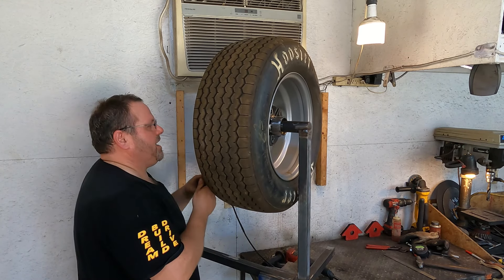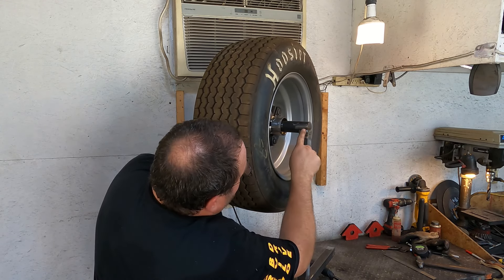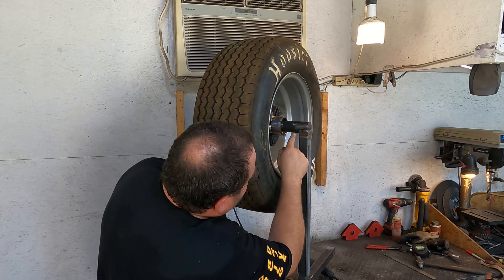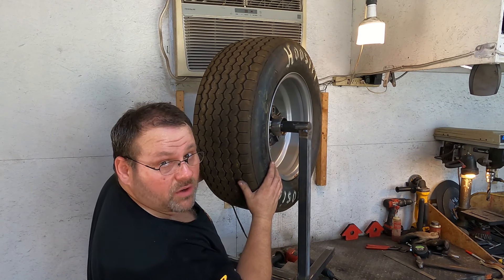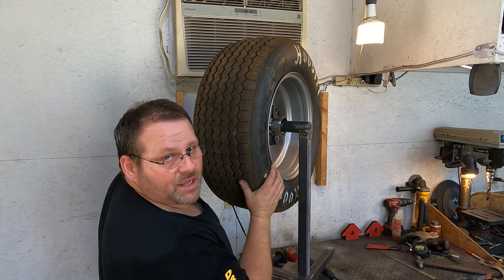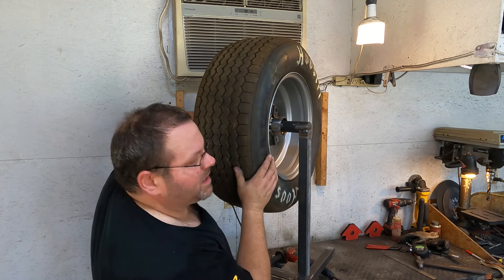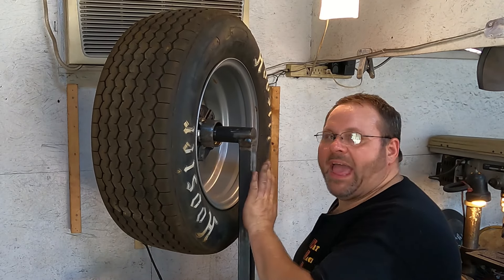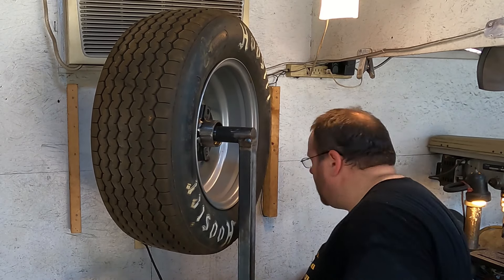Let's get a tire up here and see if I've got enough clearance — I think I planned this right. Oh yeah, I've got enough clearance. This wheel right here is a four-offset wheel, and four offset on an eight-inch or ten-inch rim is my deepest. I was able to set this spindle back to the back and have clearance. You could also mount the spindle to the face if you need more tire clearance — just pay attention to it. You could also add a one-inch spacer if needed. So within about 30 minutes of real work, we now have a functional tire stand — we could buff all day on a stand like this.